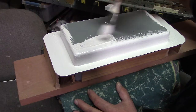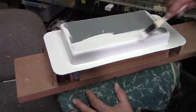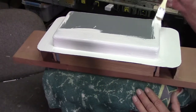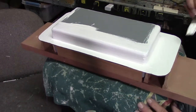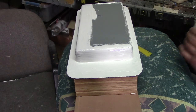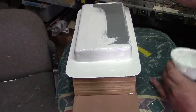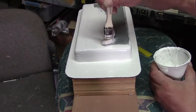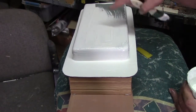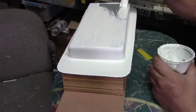I mixed up way too much — should've just done 50 grams. We just want a nice even coat on here. We do this twice. We just want this to tack up; we do not want it to set up all the way, so we don't want lamination issues. For the second coat, you wait for this to tack up, which means you can touch it with your finger and it's still sticky but nothing sticks to your finger — that's when you put the second coat on.